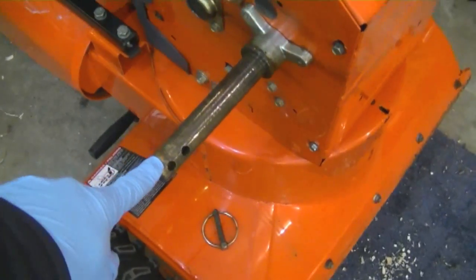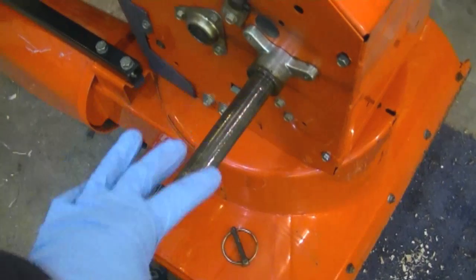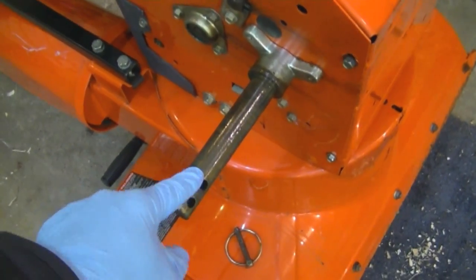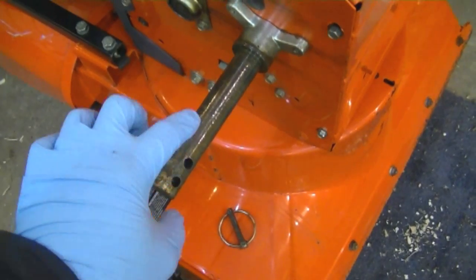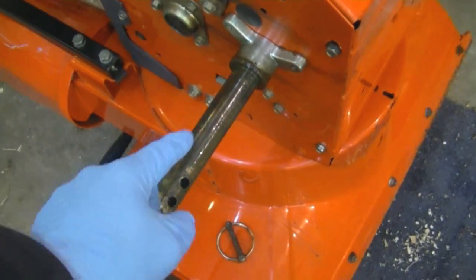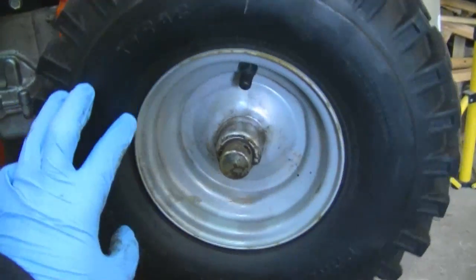My last question: a YouTuber asked why I use oil from my oiler can on the drive axles of snow blowers instead of lithium grease. Lithium grease can be expensive, and what I find with oil is that it spreads out really well and when you insert the wheel it doesn't push the grease inward toward the snow blower. This is the drive axle that the wheel goes onto. I put the wheel on and spin it so the oil gets everywhere. You can also use wheel bearing grease or lithium grease if you want.